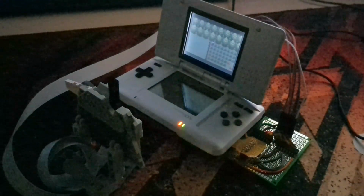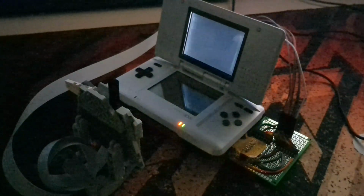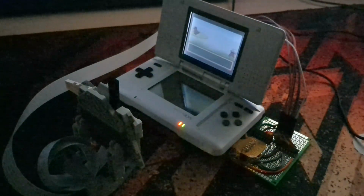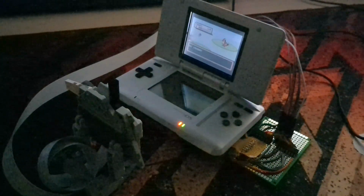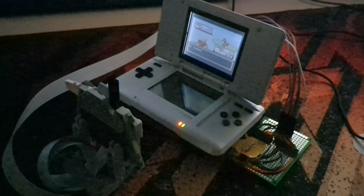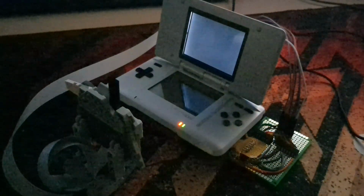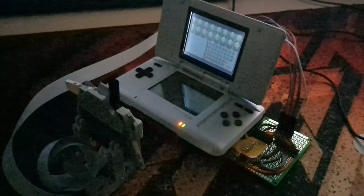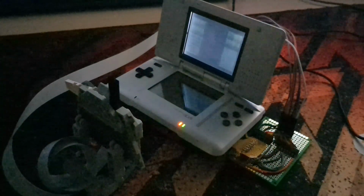Okay, I've been at this project for a while now, trying to crack this camera stuff, and it's not looking good. I'm using the basic V1 Raspberry Pi camera module for this, and it's just not good enough for what I'm trying to do. I've played around with some basic OCR by just spitting out anything it can see, and the results are so messy and inconsistent because the camera is struggling to take clear pictures. And when I try to point it at the Game Boy and DS screens, it's even worse.